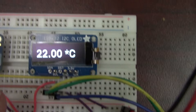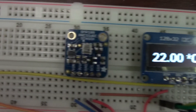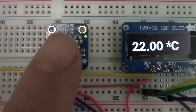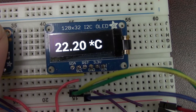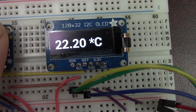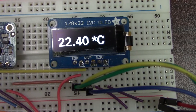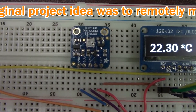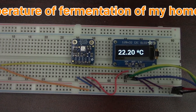That's an I²C OLED display with the SClock and the SDA lines. And now you can see the BMP180 pressure sensor. Both of these are from Adafruit — 3 volts, SClock, and SDA. As we warm up that sensor it's going to adjust the temperature. This particular setup has a sample rate every five seconds; it's going to poll that temperature sensor.